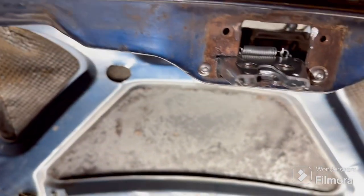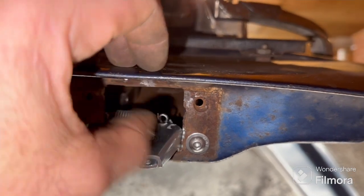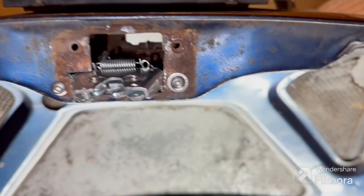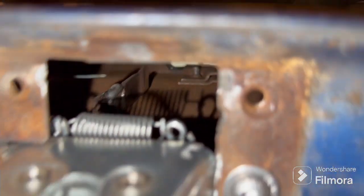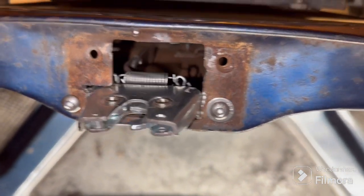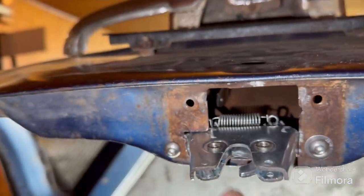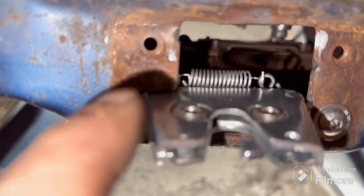Here's what I had to do — I had to chop this thing up even more. Right there with the flap disc I had to cut this off. I'm still going to smooth that out with a file, to be able to get my finger in there because I couldn't bottom-mount it — it was binding up. I shortened it too much. See, I cut it and welded it right there. What happened is where I had it mounted I didn't test fit it to make the bend right, so I shortened it and once I did that I tried to adjust the bend in it and it was binding up and it wasn't doing its thing. So I opened this up a little bit more.